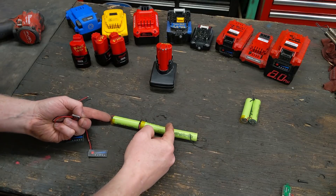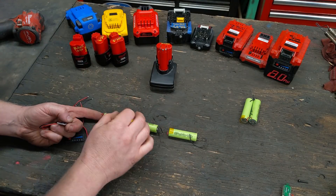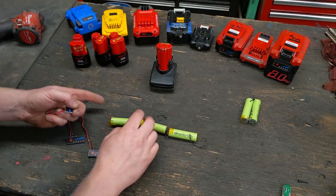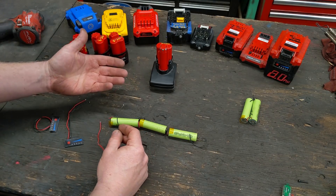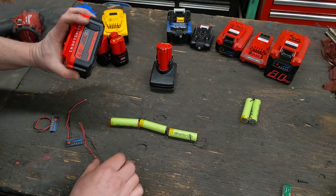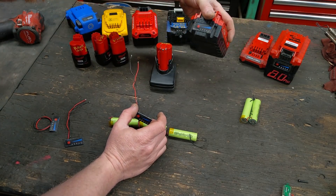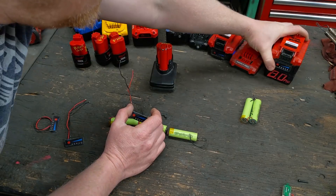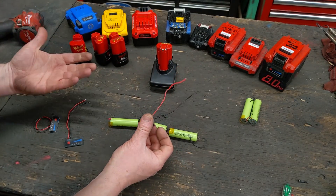I can use a 2s meter in a 12-volt pack by measuring between just two of the cells. I'm only taking the voltage of two cells, but that gives an excellent representation of the entire pack's charge because these are all balanced-charged by the charger. For a 1s gauge, you can just take the reading off any single cell. I found 5s gauges were almost impossible to find, so I've been using 3s and 4s in these packs. This 2s will show me exactly what charge is on there — find the cheapest configuration available and get it.